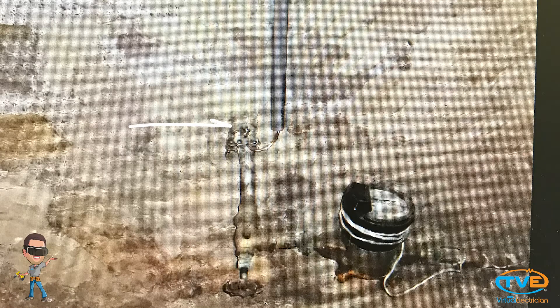Any two will do. The first thing to do is to try and find what you have. Check the water line first. You don't have to run all over your house looking at different parts of the water line or try to find the ground wire. To properly ground the water line, the ground wire needs to be connected right where the main water line enters the house.